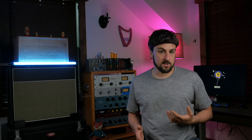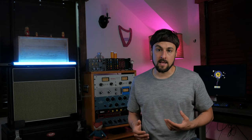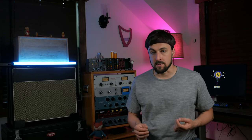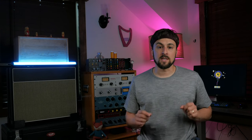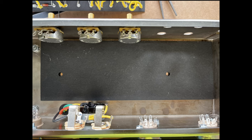If you opt to place the switch here, you'll need to change how the circuit board is mounted in the chassis. There isn't enough room to mount the board without a slight modification. To do this, first line up the backing board and the eyelet board, making sure the mounting holes are aligned. Now, place them in the chassis to get a feel for how they should be mounted. Keeping the two boards sandwiched together, remove them from the chassis, noting the orientation. Take just the backing board and place it back into the chassis. Pull it out and flip it on the horizontal axis. Place it back in the chassis.